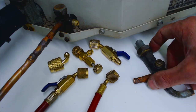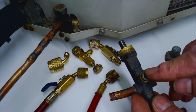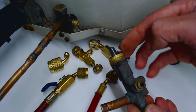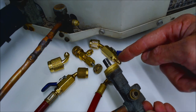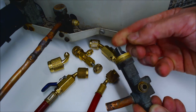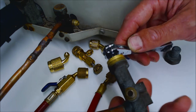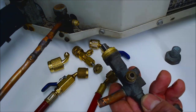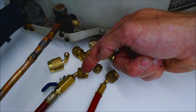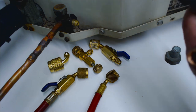The three-position stem valve has no valve core. To gain access, make sure the stem is back seated — meaning the stem is all the way up. Connect your refrigerant hose onto the port, then mid-seat it using a ratcheting service wrench with just a couple clicks. Then you have refrigerant coming out of the port through your hose and into your manifold gauge set to read your pressure.